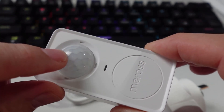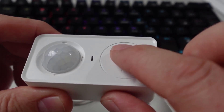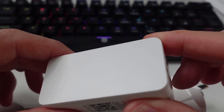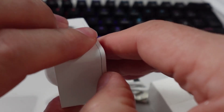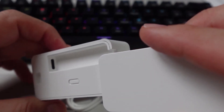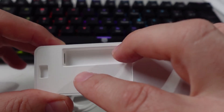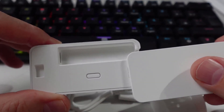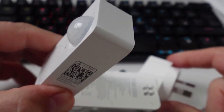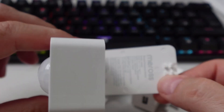Having a close look at the sensor, you can see we've got the passive infrared dome, the status LED, and the millimeter wave sensor on the side. There's a Matter pairing code, and on the back you pull up a little piece which flips around to reveal the USB-C port for your 5V power supply, along with the pairing button. The swivel base lets you stand it upright or mount it against the wall with a reasonable amount of adjustment.